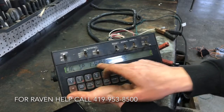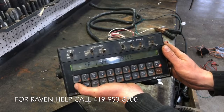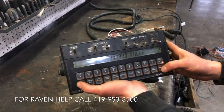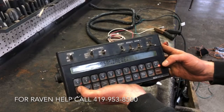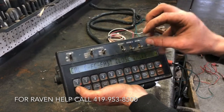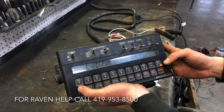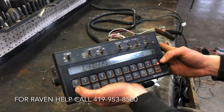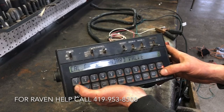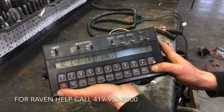For speed — SP — are we doing wheel drive or are we doing radar? The CE button scrolls between the two. In this case I'm using my Garmin, so that's radar. Hit enter to confirm radar. Now, what kind of valve are you using — a standard valve, a fast valve, or a fast close valve? That is determined by whether your valve is separate from your section valves. If your control valve is also your on/off, you'll be using either fast valve or fast close valve depending on how it's set up. PWM valve you're not likely to use on an anhydrous bar. Standard is very common on liquid setups. Choose your valve type and hit enter.